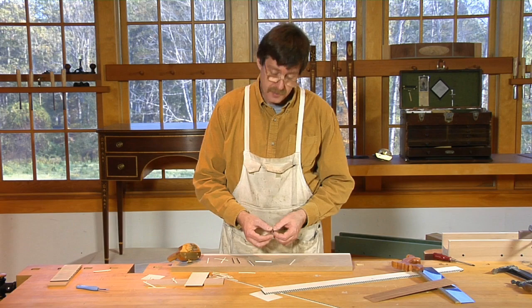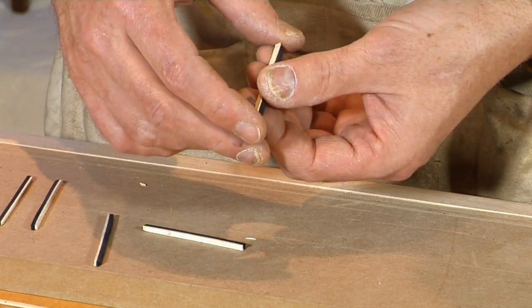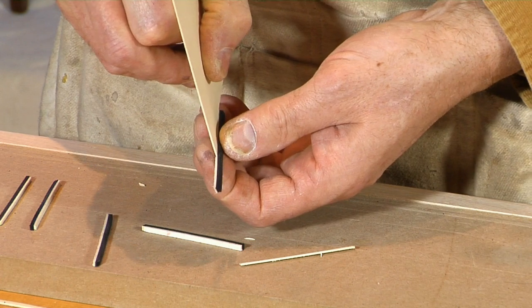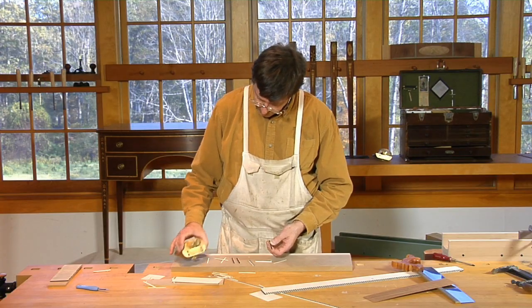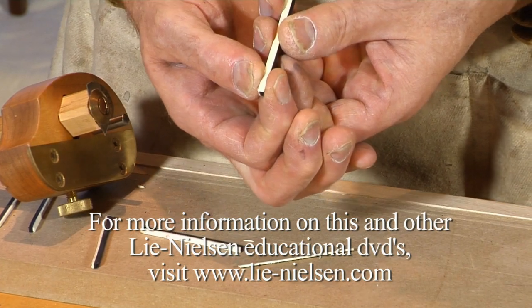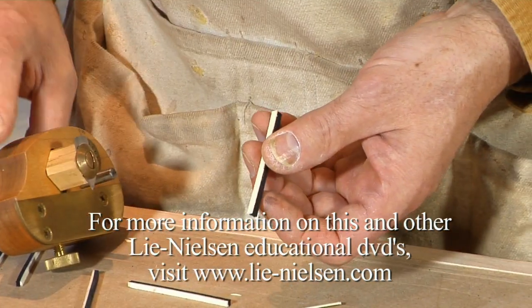For each one of these combined black and white pieces, I need to make a divider piece that goes between them. This is made from veneer that was used to laminate these together — that way it's the same thickness. I'm going to slice them off using a slicing gauge, and I need to make these white strips the exact same width as the combined thickness of the assembly. That way, we'll have a nice undulating line.